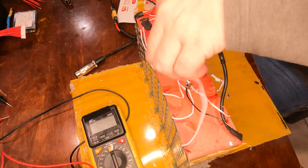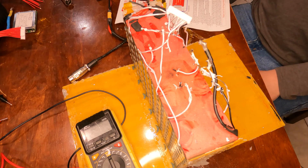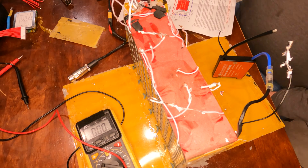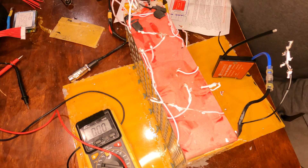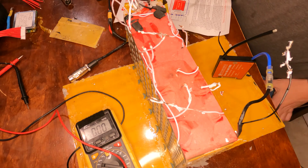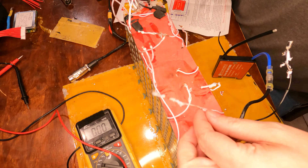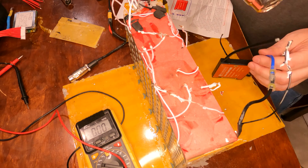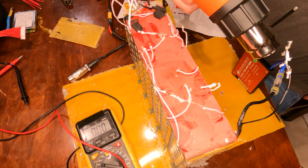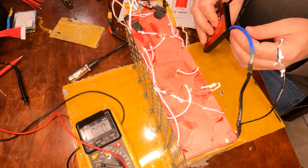I'm smoking — oh Jesus! And that's how you disconnect all your wires instantly. So yeah, learned that lesson — keep the heat gun far away from the balance leads. They've got quite fragile plastic on them. That was a little scary — actually, it was hell of scary. I wouldn't do it that way. That looks like a pretty good connection there, though.